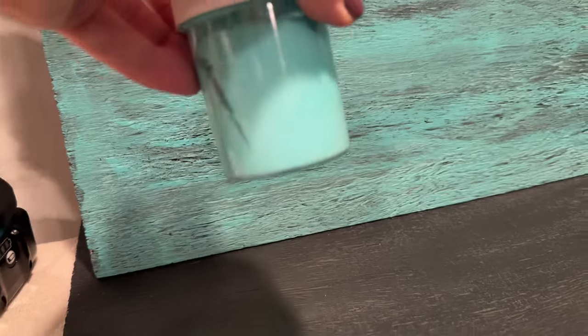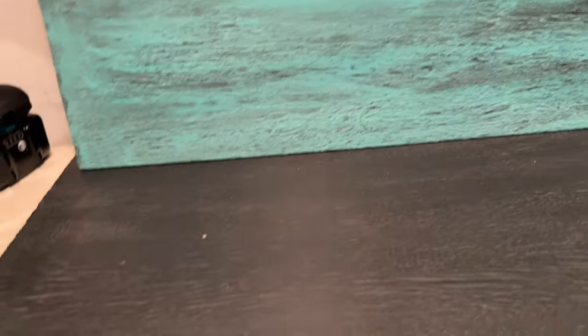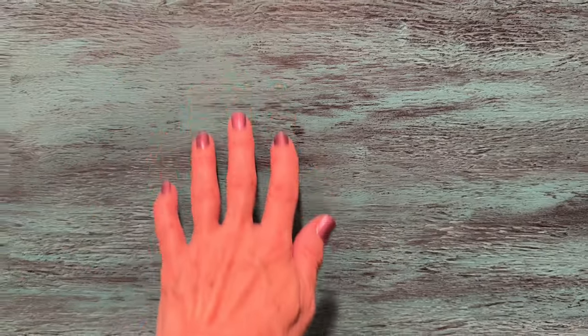The boards I have are two feet by two feet, and I've painted those. I kind of like the look of chalk paint. I've used chalk paint, doing one in black and one in blue. For this variegated look, I painted it black, let that dry, then went over it with just a little bit of turquoise chalk paint. Then I let everything dry and put on cream wax, let that dry for about an hour or two, and buffed it off with a t-shirt material. That gives a satin sheen, which I like for photography because if it's too shiny it interferes with the light.